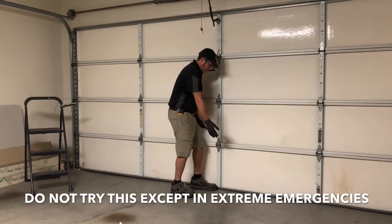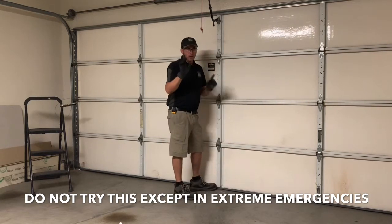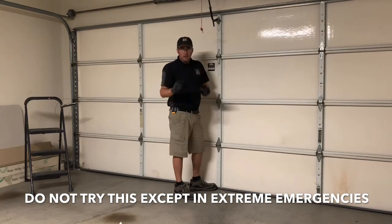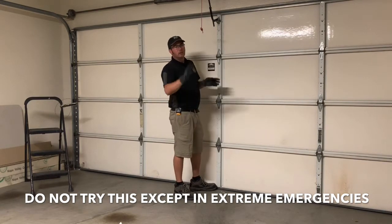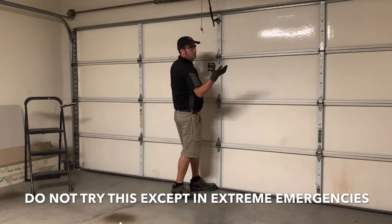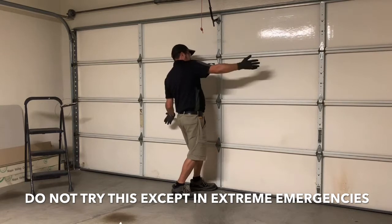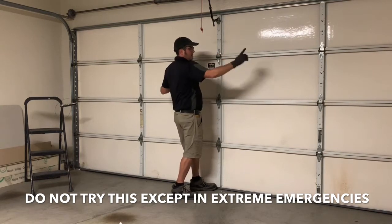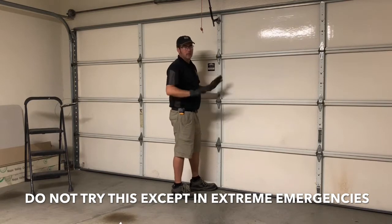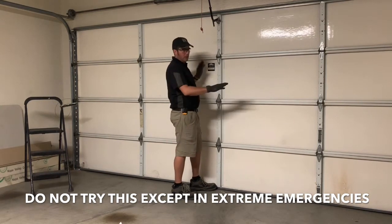You can also have a set of blocks to push underneath to get your first hand hold. While lifting, you want to make sure the door stays level. If you had two people — which is obviously helpful — one on each side, you can't have one person lifting higher than the other because the door will get wedged and things go really bad. Two people get frustrated and give up, and you don't want that. Remember, this is about 200 pounds.